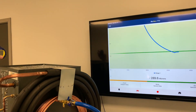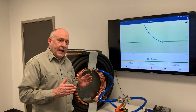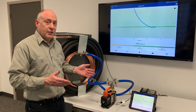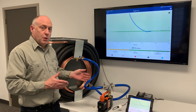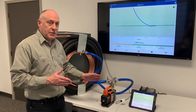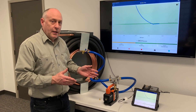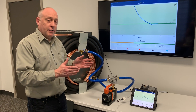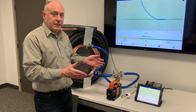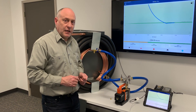What's so important to understand here is we pulled this system down in about 6 minutes, and the NAVAC pump has about an hour of run time on the battery, so you could easily get four to five systems — five-ton systems — evacuated with a single battery when you pair the NAVAC pump with the True Blue hoses. We were watching some videos online where guys were using this pump with quarter-inch hoses, and it was requiring multiple batteries to get the evacuation done. When you pair it with True Blue, you probably don't need them. Five-ton system, 3/8 by 7/8 line set, six minutes start to finish — we're done. This is Jim Bergman with MeasureQuick, thanks a lot for watching.